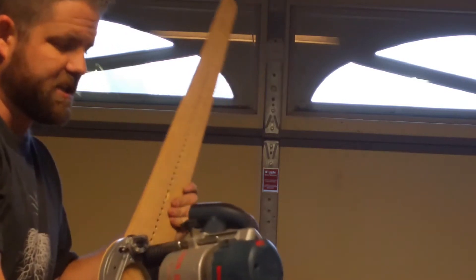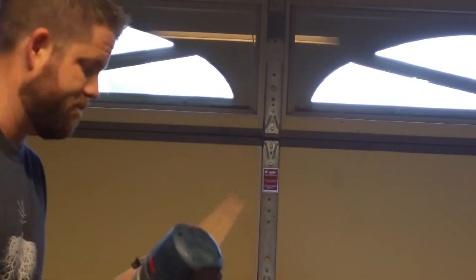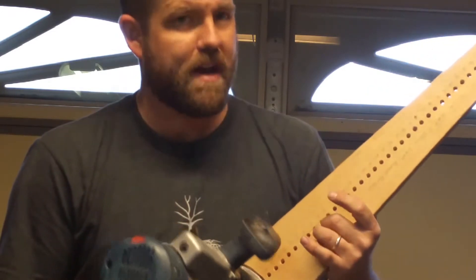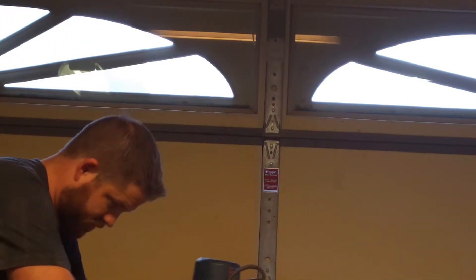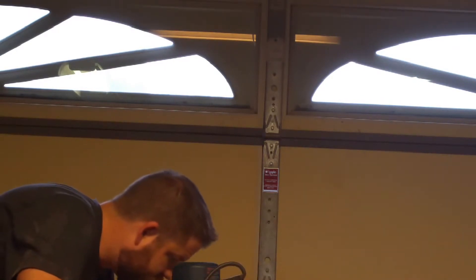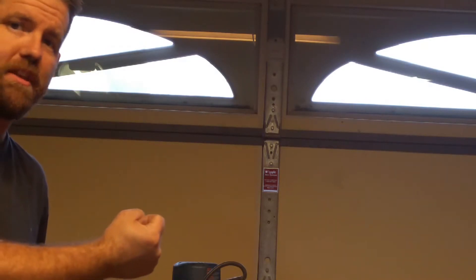I made a circle-cutting jig for my Bosch router. This is a plunge router, which is really nice to cut circles with because you can go a little bit at a time. As you can see, it's just a long piece of plywood with lots of holes drilled in it, each one signifying a different radius cut. The inside of this I believe was 18 inches, so we need nine inches — which is right there. The central pivot point is nothing more than a quarter-20 bolt, and we'll start routing.